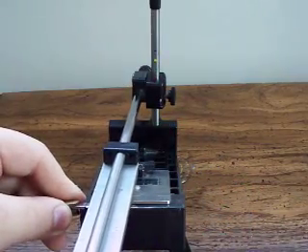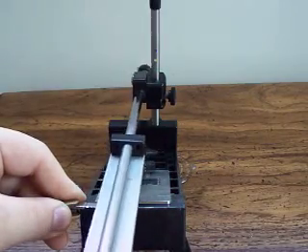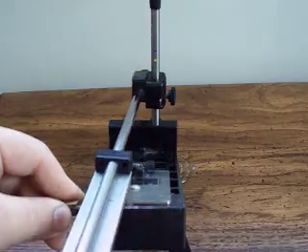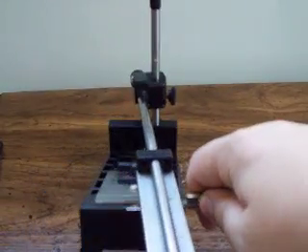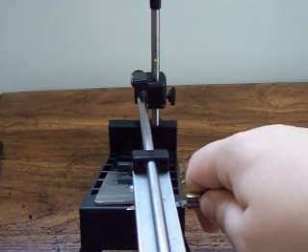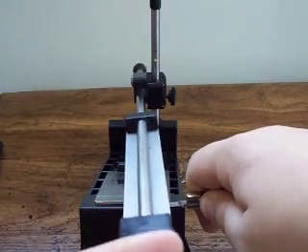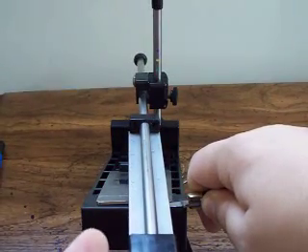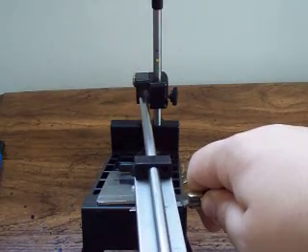You want forward, very light forward strokes. As I'm going forward, I'm going off to the side a little to accommodate the length of the blade. It doesn't take much — very light pressure. Flip over the other side. When you're doing your forward stroke, use very light pressure downwards. When you're pulling back, I tend to lift up, but even if you're sliding on the blade that's fine — do not put downward pressure on the back stroke. Just use the weight of the stone to pull it back.